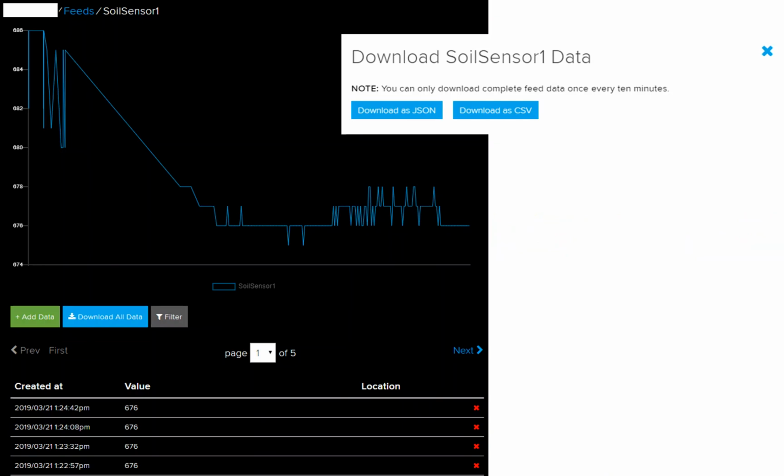Once we flash that to the board and press go, we start getting pretty graphs and we can see what the soil sensor is saying. At the very bottom here, you can see values, which will be between 0 and 1,000. You just have to gauge based upon how wet you think the soil is and how wet you think it should be, so you can start setting limits on this.